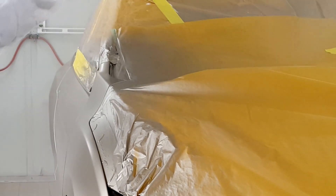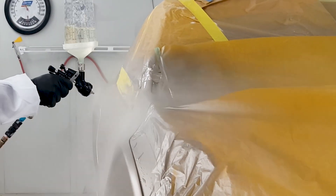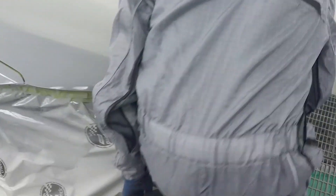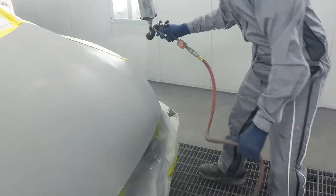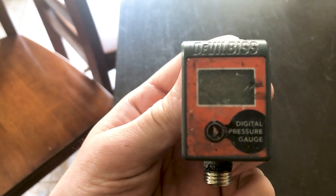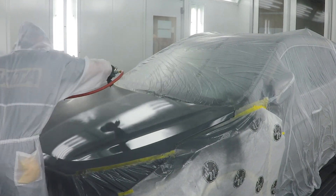Having said that, there are many professional painters that, given the choice, would prefer to do everything with the Prolite. The included DeVilbiss digital gauge is a nice touch for the gun and initially is easy to read. However, they are difficult to remove overspray from and aren't overly durable. Many technicians, myself included, have had to replace a few of these over the years.